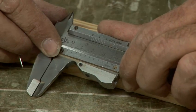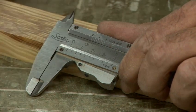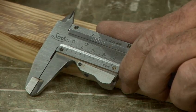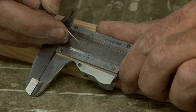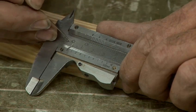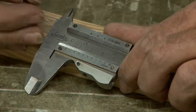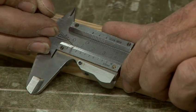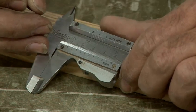If you go to there, the zero is halfway between the nought and the one. We could guess that's half a millimetre. But you can actually look — because we want half a millimetre, when the five line is lined up with something, that's half a millimetre. See here the two line isn't. So we can move along — that's nought millimetres. And when the one is in line, that's point one millimetre.